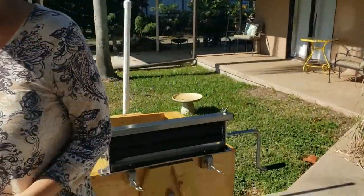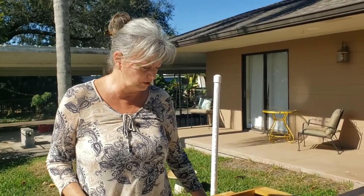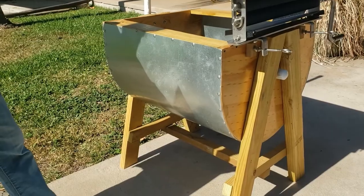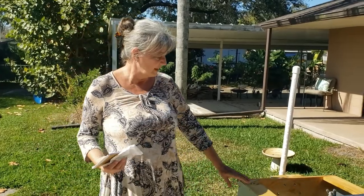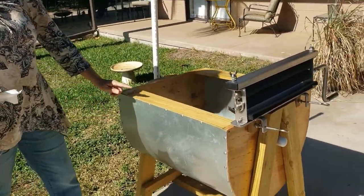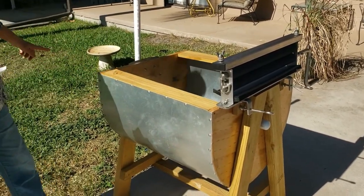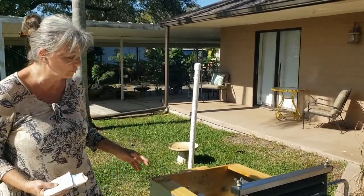Then this here is the sheet metal. This sheet metal, I believe this is 26 gauge. If I did it again, I'd probably make it 24 gauge — it can dent and I think a little heavier would be better. I got this sheet metal from an air conditioning sheet metal place right here in Lakeland, Florida. The size of this is 50 inches long, and this way it's 26 inches. You can make this longer if you want — you could have a giant tub — but then for a small load it's an awful lot of water. I thought 26 was a pretty good size.